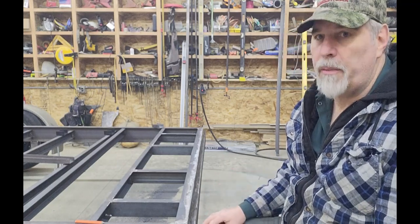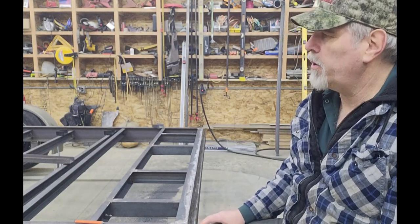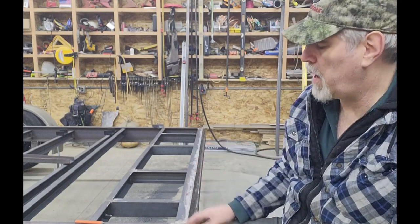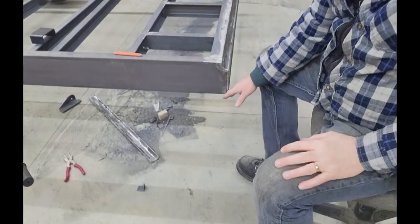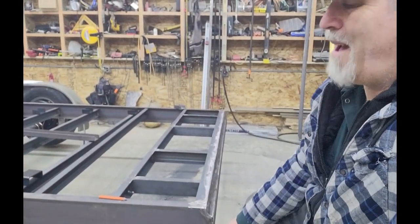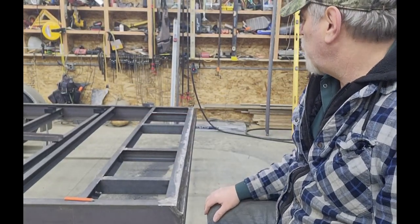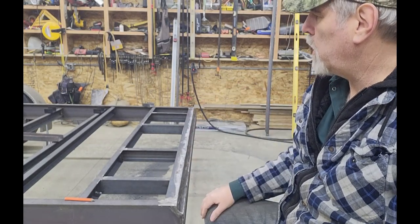I won't do that until the ramps are mostly made. I'm getting close to the point of laying out the rest of the materials — including the wood decking — to get the suspension to compress the normal loaded amount. That way I can determine the height from the trailer to the floor, and then basically the beaver tail will be half that distance, which tells me how much pie piece to cut out to bend it down. But first I need to finish welding the cross members.